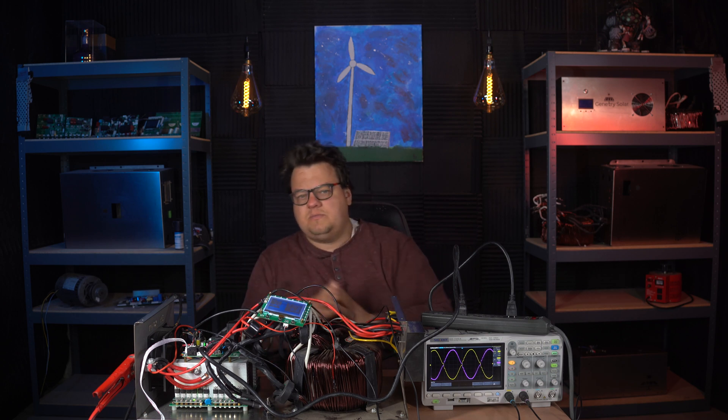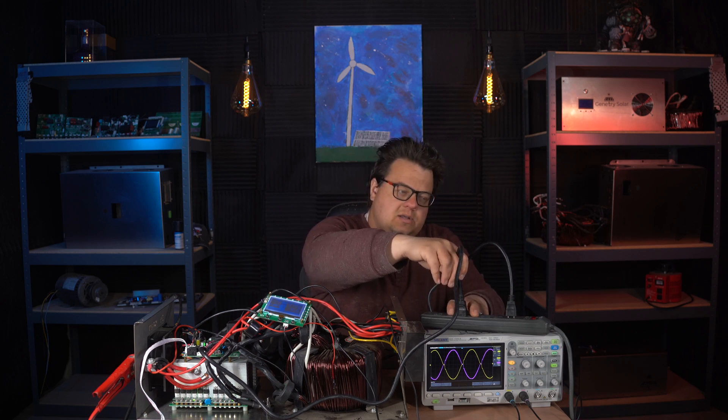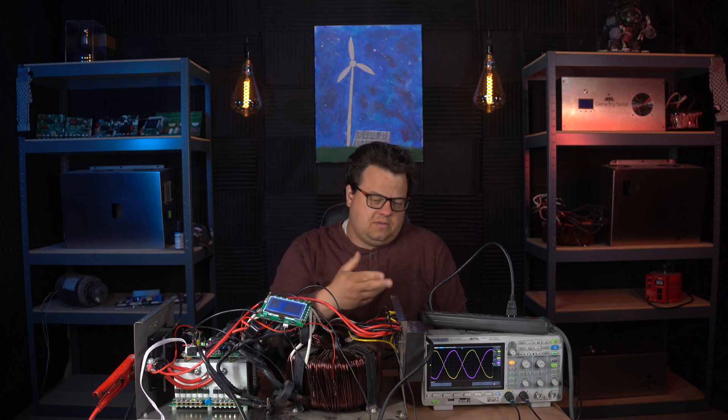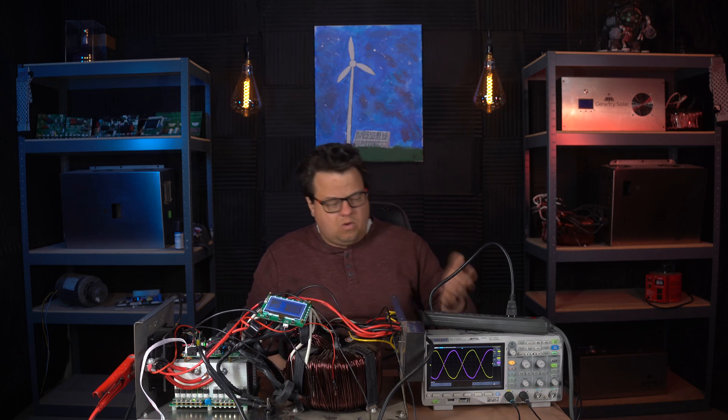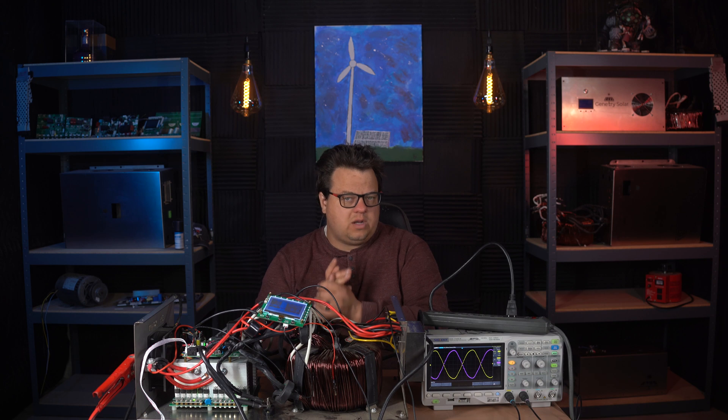Of course, if you have 240 volts input, you can get the same 240 volts output. I'm going to go ahead and disconnect the grid, and you'll see on the scope it'll go back — well, you probably won't notice it because it's almost instantaneous. We're still generating 240 volts split phase regardless of whether the input is connected or disconnected. It does not matter — you're getting 240 volts out, split phase. Just another one of the awesome features of our inverters, standard on all inverters. Now, if you do wire a 6,000 watt inverter for 120 volts output, you're not going to get 240 volts split phase — that is only for a select few that requested 120 volts output. That's a full 6 kilowatts at 120 volts, and you'll need to set it up specifically for that situation.